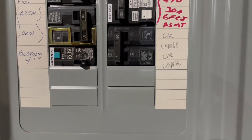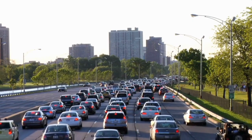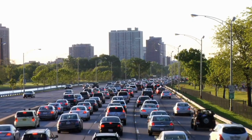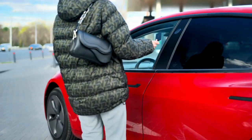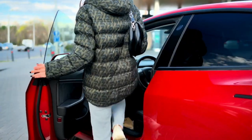Do you need to spend that $900, or whatever the cost may be, to have a 50-amp circuit installed? Well, the answer really depends on your driving needs. If you have a significantly long commute, you need that extra charging speed. If you have a shorter commute or no commute at all, and the bulk of your driving is just around town, you can probably live off a standard 15- or 20-amp circuit if you have one in your garage.